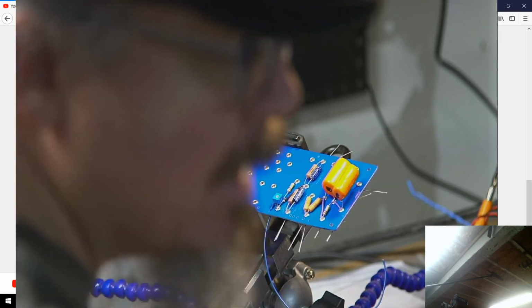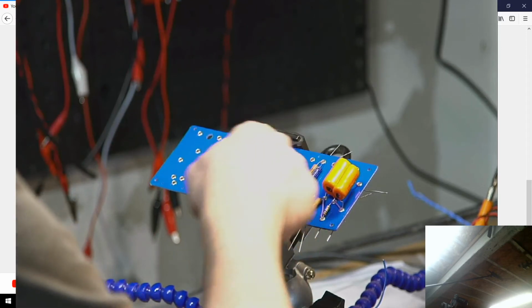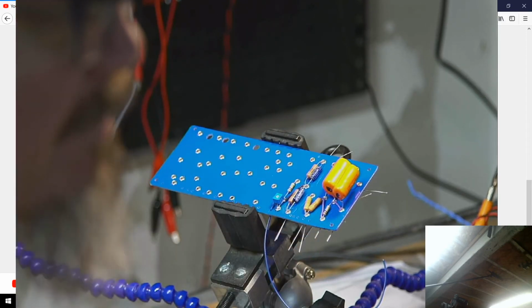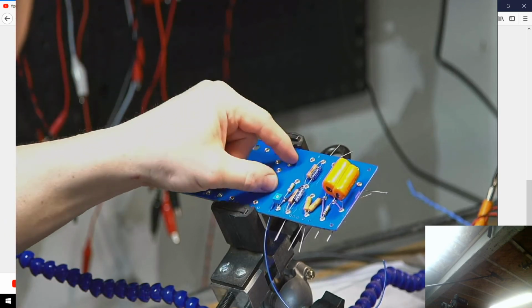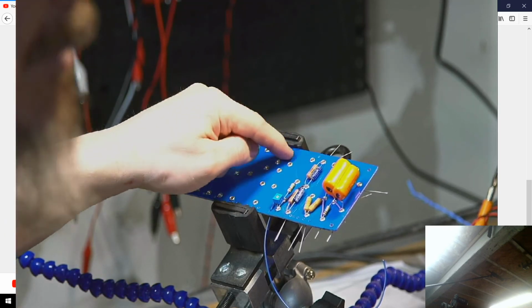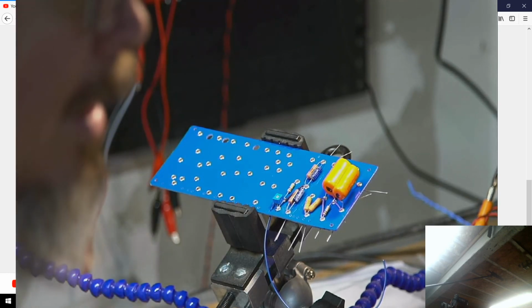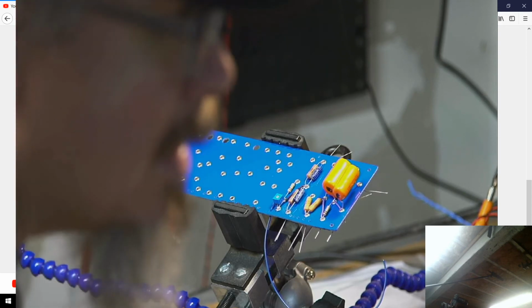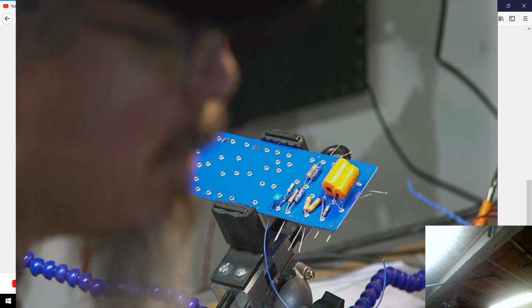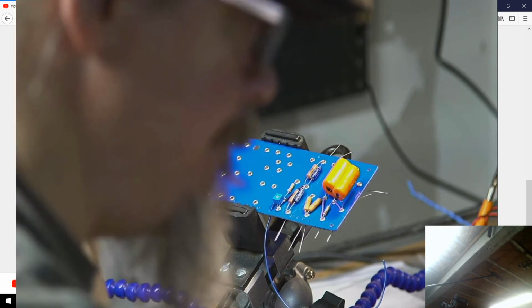Trying to look at that. Oh, we got a jumper. Okay, so jumper. So I probably want to put the jumper down first. There's a small jumper that goes from here to here because these larger capacitors need to kind of connect down to here before they go over. This one does anyway. So I will get a small jumper for that. That can be more of a signal style jumper.